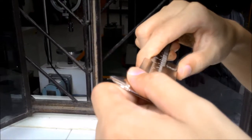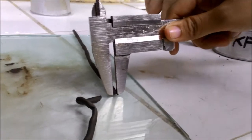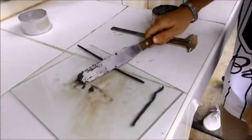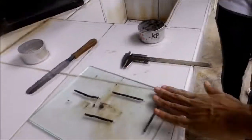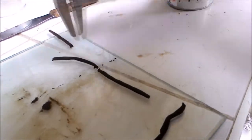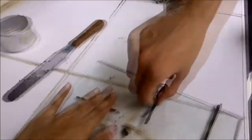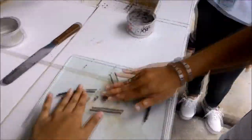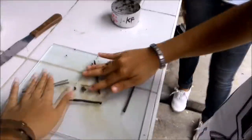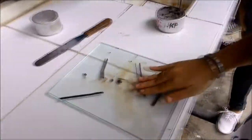Calibrate the Vernier caliper and measure the thread. Break the thread into pieces, then squeeze, knead, and roll again to form a 3.2 mm diameter thread. Re-rolling or remolding causes the sample to decrease its moisture content. Continue the re-rolling or remolding process until the sample crumbles and can no longer be remolded into a thread.